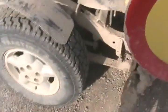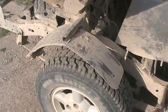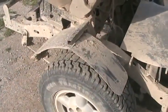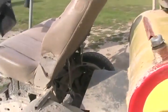Next, look at that decrepit fender — it's barely hanging on. It's easy to get into this thing by stepping on the leaf spring and climbing up onto the pad. But some people decide to step on the fenders, then realize what they've done, bend it down, and then bend it back up. When it gets enough bends up and down, the metal fractures. That one's completely gone, so I'm going to have to re-weld it, replace that piece, and weld another support bracket in there.